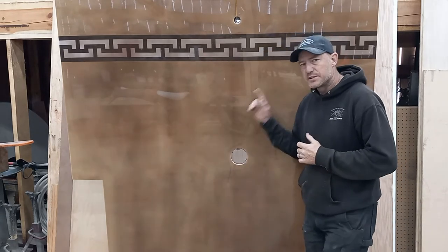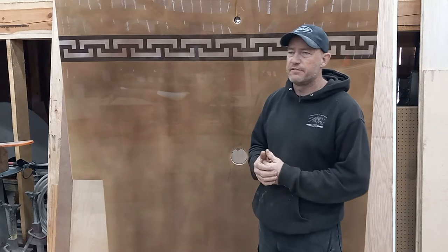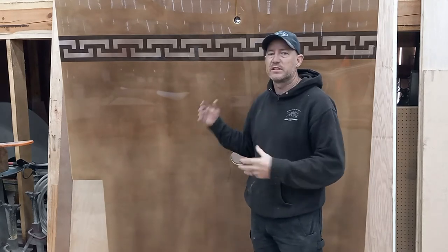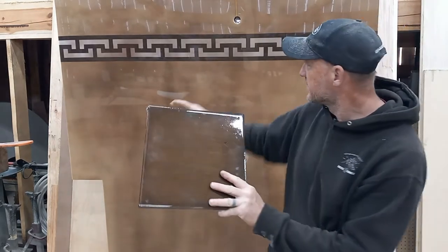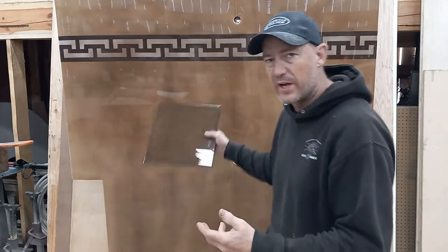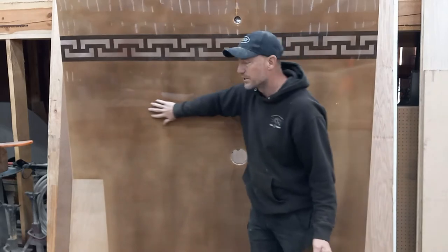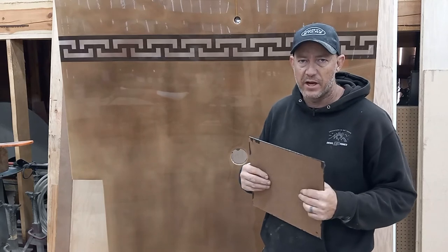This is not going to stay this way — we're going to redo it. It'll cost more epoxy and a little paint, so it's not super expensive, and it's still a fraction of the $10,000–$20,000 this custom shower would cost to have made elsewhere. We're going with the black test panel — it's not really black, it's more of a darker bronze look. The bonus to redoing it is you won't see the grooves anymore, since the surface is now flat and floated out nicely. We'll sand with 120 grit and apply the same mica powder mix after painting it black.